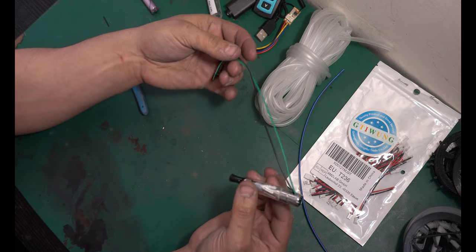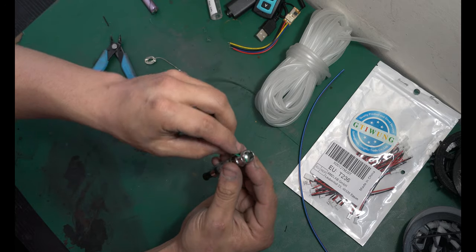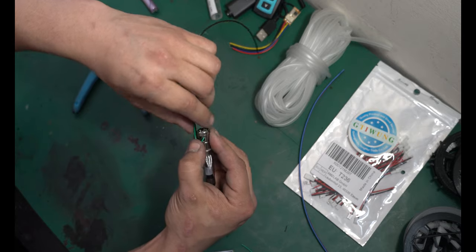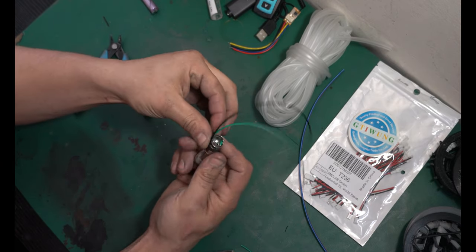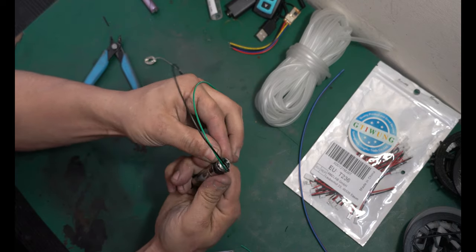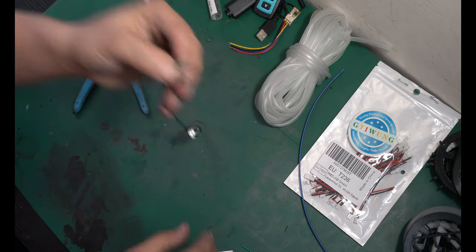Now we have a positive and negative soldered to the vape canister. Next thing we're gonna do is throw just a little bit of tape around this to hold it in place, because I don't want the wires to ever be pulled on accidentally, and then we're gonna test. Also, while doing this, try to seal up that hole as well. Use some type of vinyl tape or electrical tape, but you're gonna wanna make that airtight as the wires come out of it. Good to go. Strip back the ends of the wires so we can test it out.